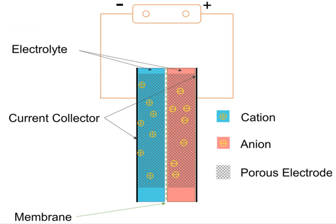The 10 degrees rule, used for electrolytic capacitors with non-solid electrolyte, is used in those estimations and can be used for supercapacitors. This rule employs the Arrhenius equation, a simple formula for the temperature dependence of reaction rates. For every 10 degrees Celsius reduction in operating temperature, the estimated life doubles. L_x = L_0 · 2^((T_0 − T_x)/10).